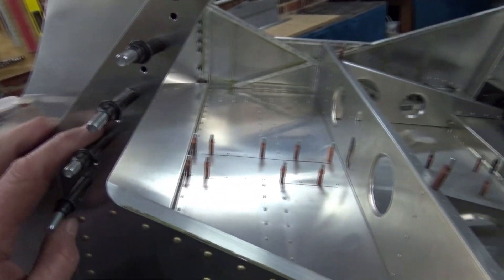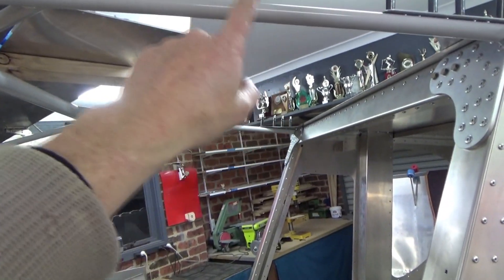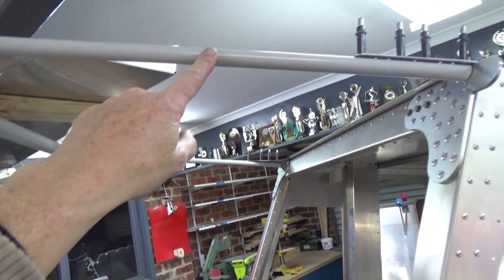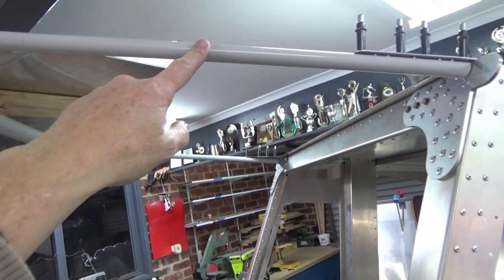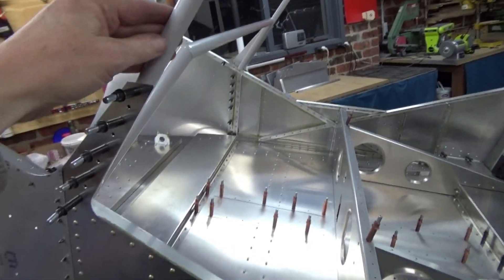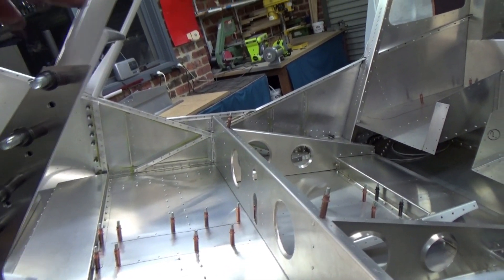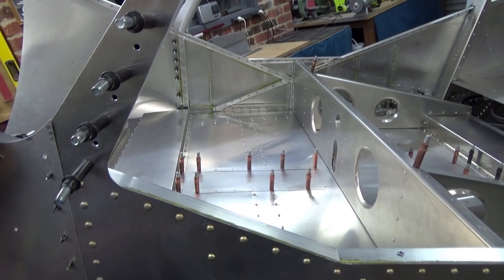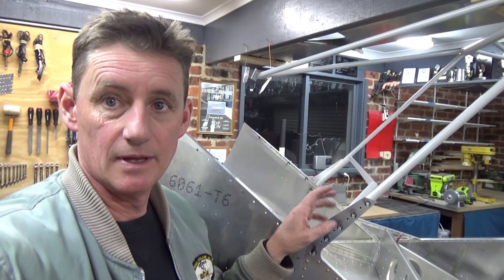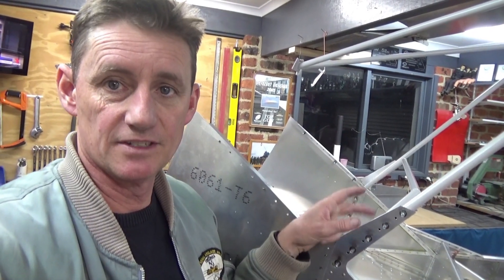I've kept the cage clecoed on just to give me an out if I need it. One concern is I've still got to drill some more holes in the cage, and if I punch a rivet in or break a drill off, it's going to live inside that tube. I don't plan on breaking any drill bits, but if a rivet doesn't set properly and you punch it in, the rivet tail ends up floating around in the tube — loose rivet tails inside a tube, doesn't make sense.